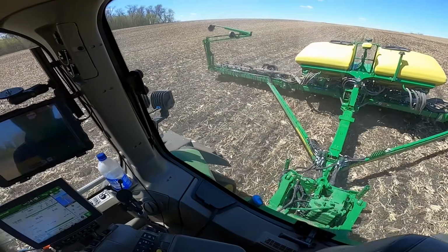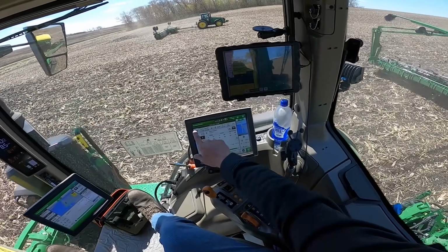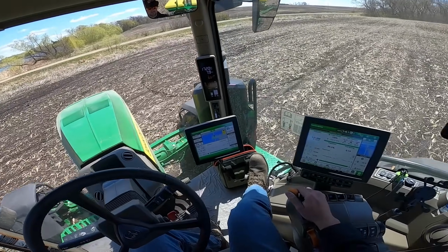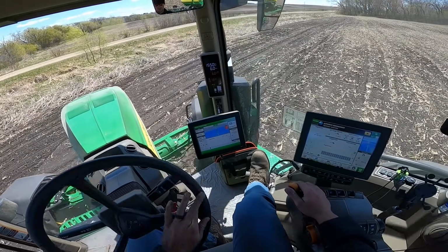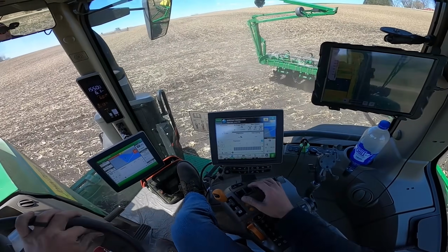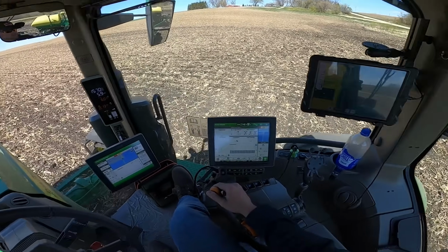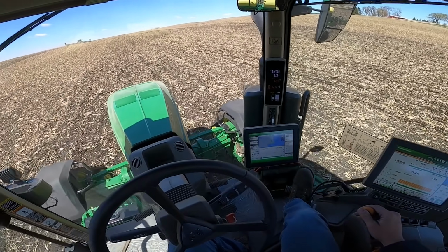Okay. It's not throwing a code. That's the weird part. Usually it'll throw a code at you. Yeah. And now it's doing it. And I don't even have the digger in the ground. It's doing it in 8th gear. Huh. So it's got oil pressure. And I set the clutch in and it quits. Does it do it at idle ever? No. Man, your oil pressure should be lowest at idle, so you almost wouldn't think it'd be a lifter.